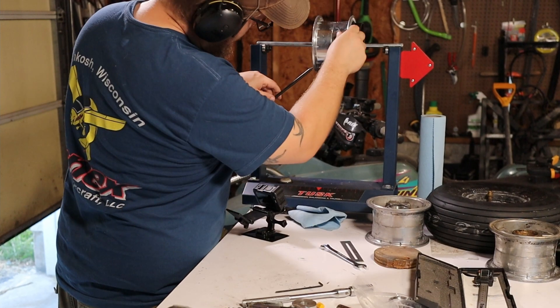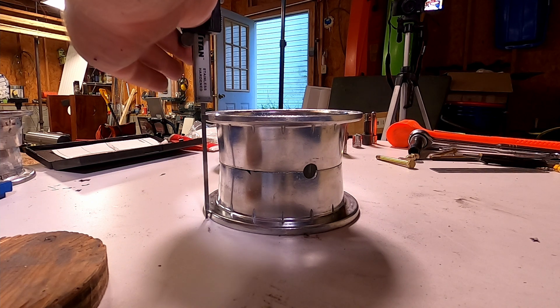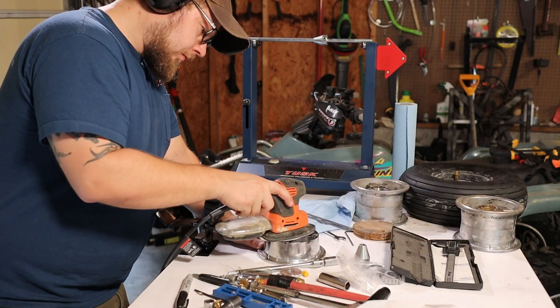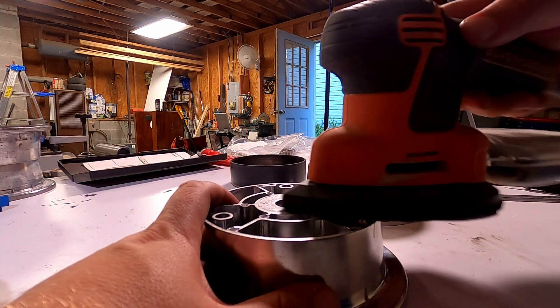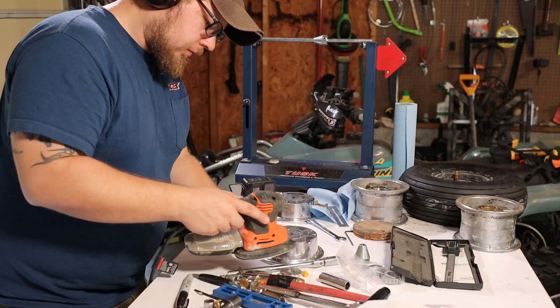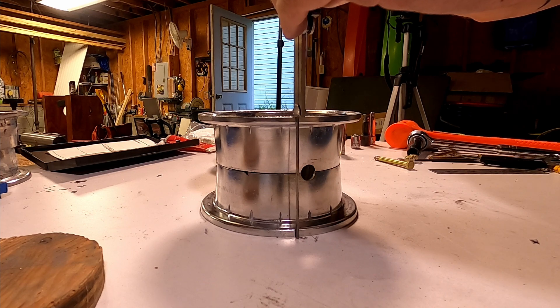Using a Sharpie and then the straight edge will bring out the more subtle ones. Even if the halves fit tightly together, they can still produce a wobble, so I like to put them together and measure the total height with a digital caliper. One side being taller than the other will certainly show as a wobble. For this I like to use a hand sander — a mouse in this case — as it will lightly sand a wide area. Sand a bit and check measurements until you're happy. It may take quite a few times. It doesn't have to be perfect, but the closer the better.